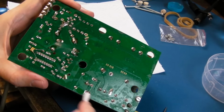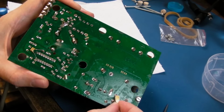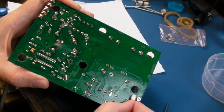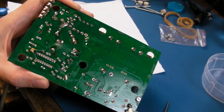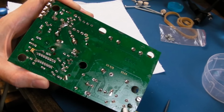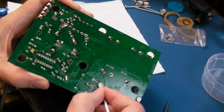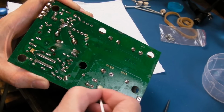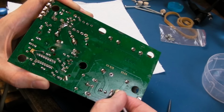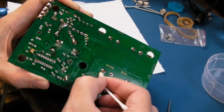I have no idea of the brand. I've never seen that style of cap. It's an old design, it's an old style. So anybody's guess, are they going to be good, are they going to be bad? I don't know. And I'm guessing they're both actually for the 5 volt rail, because the AC, you won't have a capacitor on it, that's for sure. I think there's a 2200 40 volts, and I think that's like the input to the 5 volt regulation, if you like. It might be as high as 30 volts or something there, I hope not. But then again, it's not done with a 7805.